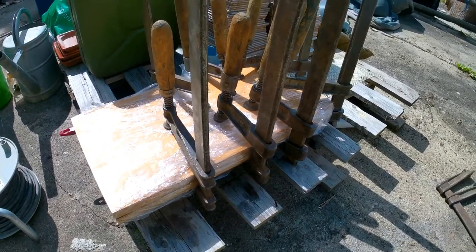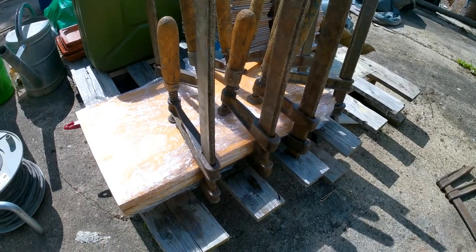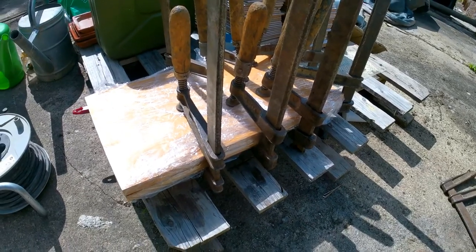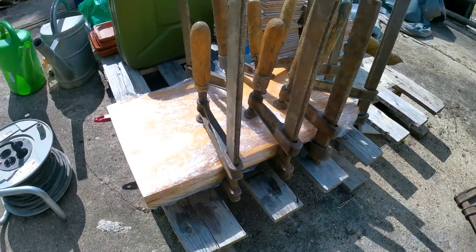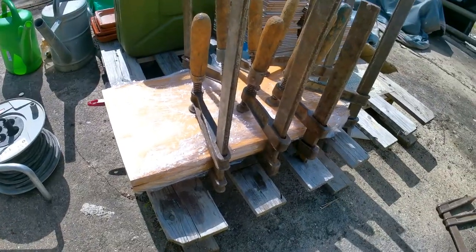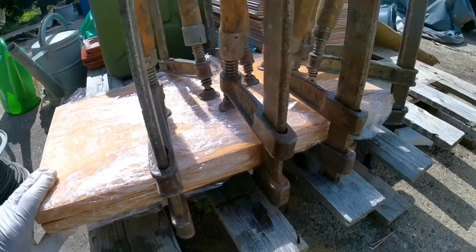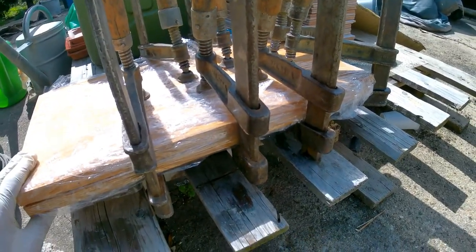After soaking all sides of the plates in epoxy and making sure that the fiberglass mats are dripping wet, pack the plates in between the two wooden boards and apply the screw clamps. Epoxy does not only need time to harden, but also temperature. I will leave this in a warm spot for about 3 days.